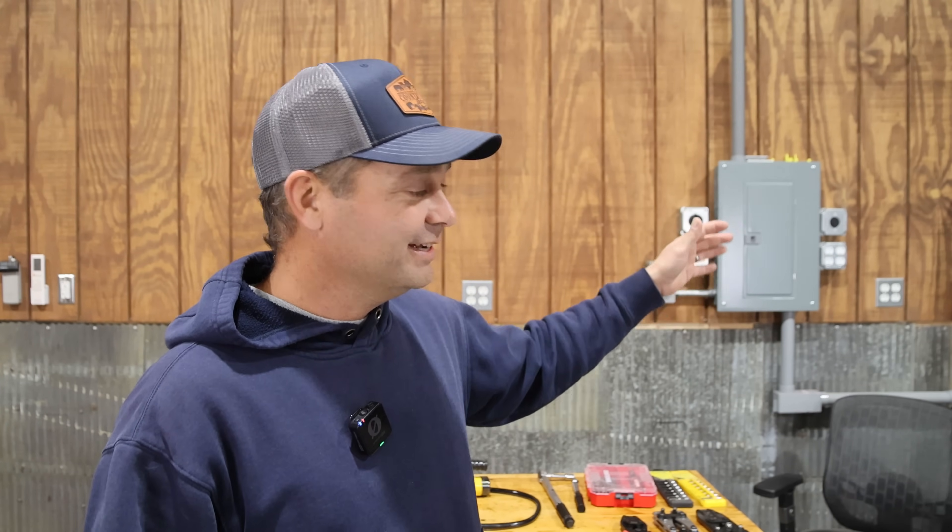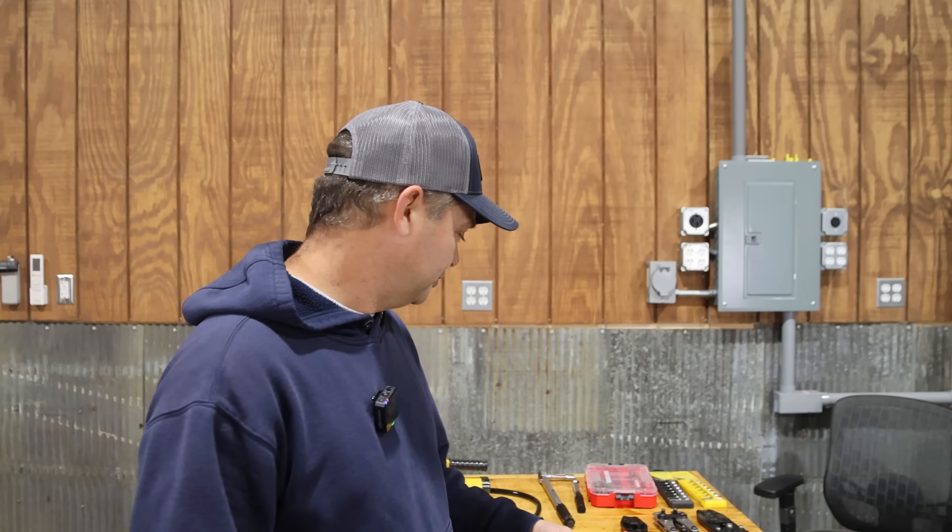One more tool that just popped into my mind: when working with solar equipment you're often doing some networking as well — CAN bus or other communication from the inverter to the battery and battery to battery. You may need to make up ethernet cable, so ethernet tools to put on your own RJ45 connectors and make custom cables could be another tool you need. Most of the tools covered here are just normal electrical tools — the only really solar-specific one is the MC4 connector crimping tool.